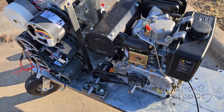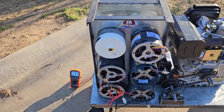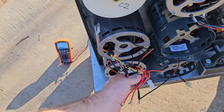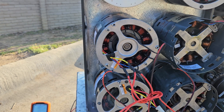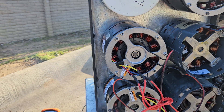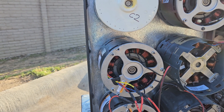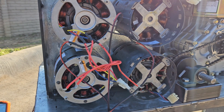Hope y'all enjoy. The next videos will be wiring this thing. We're probably going to bring all the neutrals out that I can, which means — make sure I get the camera in the right spot — we'll do it like I did here: bringing the neutrals out, so there are six wires, and you can wire it delta or star, or even take each pair individually if you want. There are a couple of things you can do.